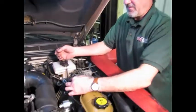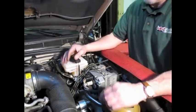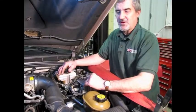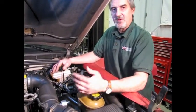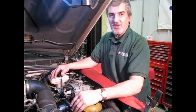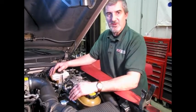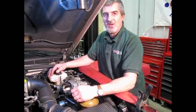To finish things off, make sure you put your two electrical connectors back on and plug in your brake fluid level connector — at that point you're done. You didn't break the lines open, so we don't have to bleed the system. You may want to clear the codes out of the ABS module. If you don't have that capability, it won't necessarily clear the code but it'll keep the light off if it sees the system is functioning properly. If you still end up with Three Amigos issues showing shuttle valve codes, more than likely you're going to need the hydraulic unit. But for the majority of vehicles, this repair seems to take care of it. When you're ready, call any of our knowledgeable salesmen at 1-800-533-2210. Thanks for watching.